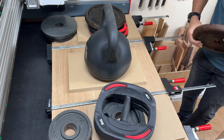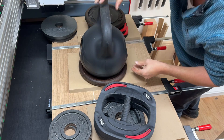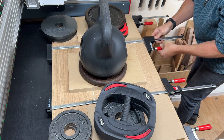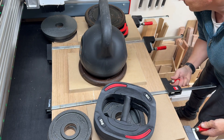I constantly seem to have the habit of over-tightening my clamps when making up a panel and ending up creating a banana, so the idea here was adding a ton of weight and only doing the clamps finger tight to try and avoid that. I think I managed it for the most part, but later on you'll see there were a few gaps underneath where I'd over-tightened yet again.